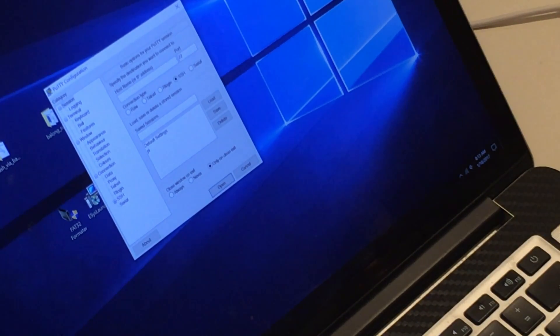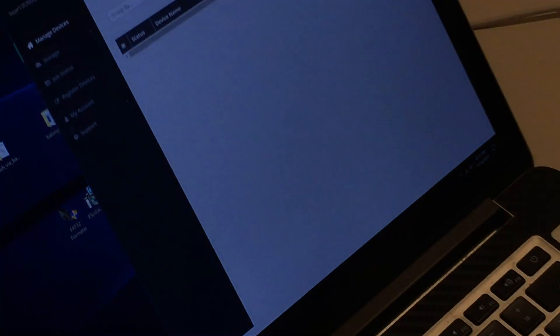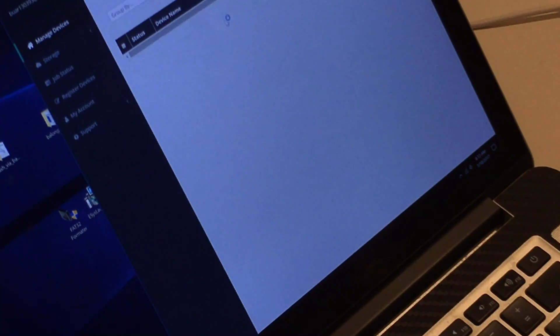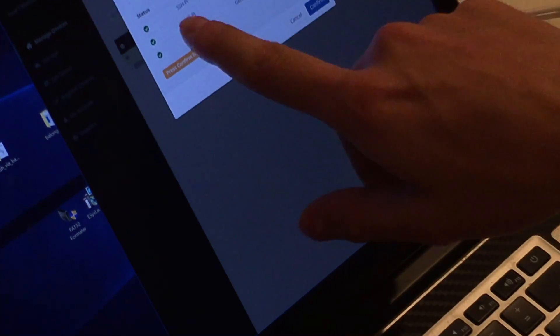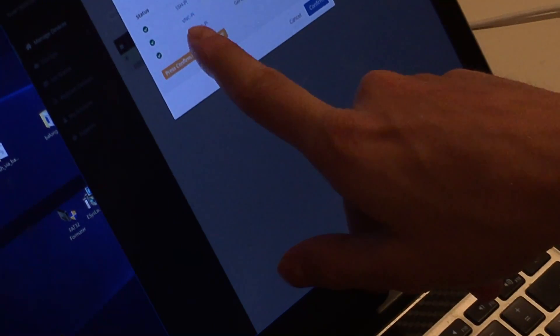To locally access it, we'll have Wi-Fi running on the Pi. On the previous recording I actually turned off Wi-Fi, so let's go. You open the website, use SSH, you log in to the website, and then you have a choice of what I have set up: SSH, VNC, and MAVLink. So you choose whichever you want — we choose SSH and press confirm.